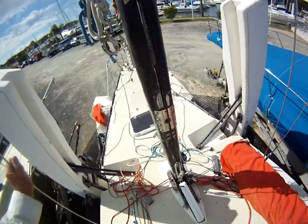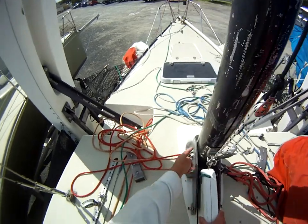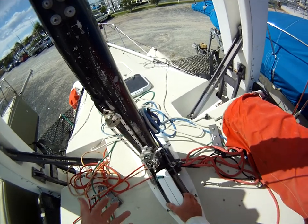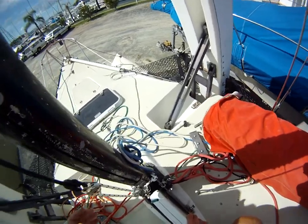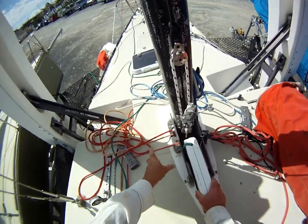Now you notice this is nice and cleared here, especially when you're getting the mast up. You want to watch this area, because this hockey stick shape, as the mast comes up, it's easy to have something under here, a pulley for example, or a rope, and you'll crush the rope, or you'll break a fitting, and sometimes the fiberglass under there gets a bit mangled by doing that. The fiberglass there is very thick, it's very safe.